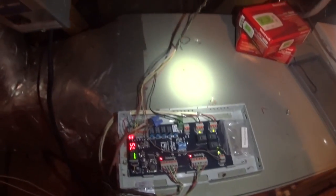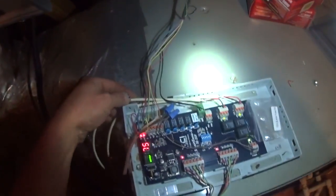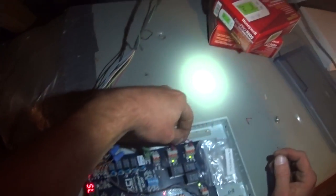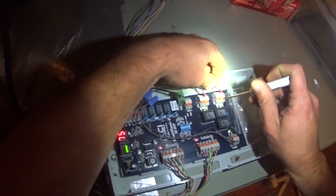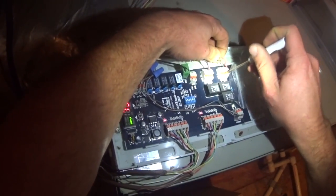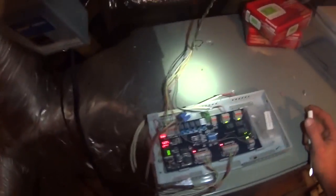Start by disconnecting the wiring to the damper that we're replacing. And it is zone 2. So depress the little orange thingy and it pops loose. No more power on that zone damper.